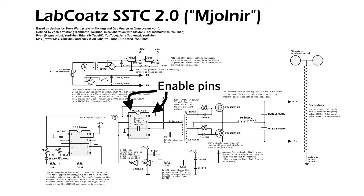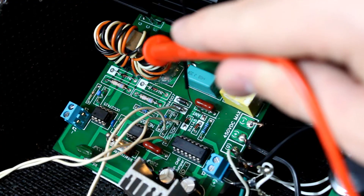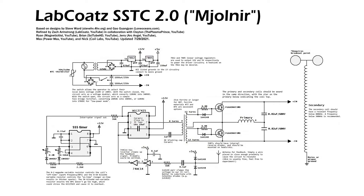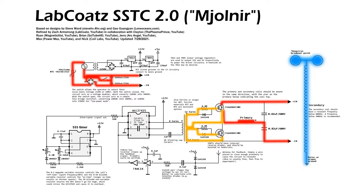Conveniently, our gate driver chip has something called an enable pin, which is basically like its on and off switch. If we feed the interrupter signal to the enable pins, we can control the Tesla's pulse duration and frequency, and therefore the spark appearance. All of this low voltage circuitry is powered by a few simple voltage regulators, which take any DC voltage from 14 to 24 volts and adjust it to the circuit's needs. The resulting interrupter signal from our driver circuit is finally sent to a gate drive transformer, or GDT. The GDT can be easily made by wrapping two 12-turn coils and one 8-turn coil onto a suitable ferrite core — I recommend materials 77 and 75. Once properly assembled, the GDT converts the single 12 volt signal from our driver into two 18 volt signals, which are optimal for switching our transistors. If we phase the GDT correctly, it will cause the transistors to switch the DC voltage from our power supply across the primary coil at the resonant frequency. Since the resonant frequency is detected by the drive circuit, we can stick basically any secondary coil in the primary coil's field and it will resonate almost perfectly, producing an extremely powerful electrical discharge.